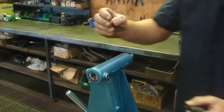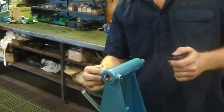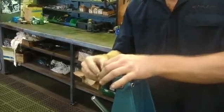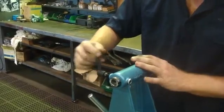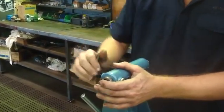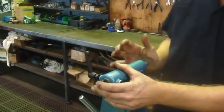After that, you want to stick the little brass piece back into the hole. Put a little bit of grease on here, replace the lever, and then just make sure it locks. It's important to have the brass in there so that you don't damage the quill.